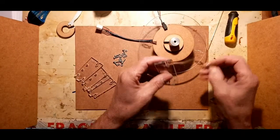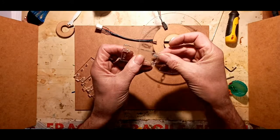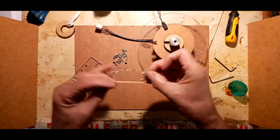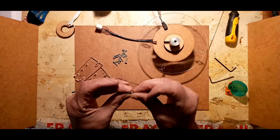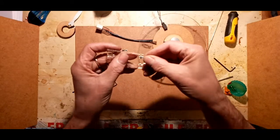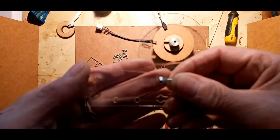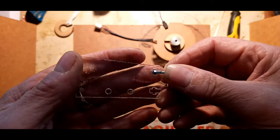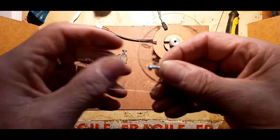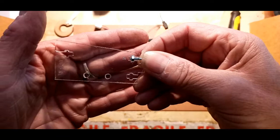And then we have a bolt that comes up from underneath. It goes into that slot, and into there we've got another slot where we drop the nut. I'll just assemble this so you can actually see the principle. So we end up with that principle there. Bring it up into focus, so you can see the nut holds itself in while you tighten the bolt up. It's a bit fiddly to do, but it's a system that seems to work quite well.